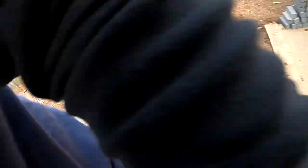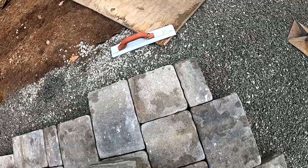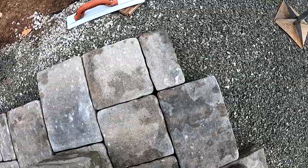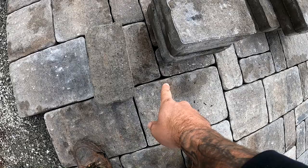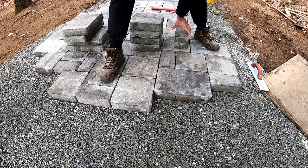Now's the time to show you what we're really looking out for when laying pavers: four-ways. That's the intersection of four pavers meeting each other — it really stands out like a sore thumb. You want a random pattern with all joints broken up into a T. We also watch out for long joint lines — we go three to four pavers at most on a small application like this, five on a big patio before breaking it up. You can see this joint line runs one, two, three, four pavers — we have to break that up by placing a small paver here so we can cross it. We also need to fix this four-way intersection.